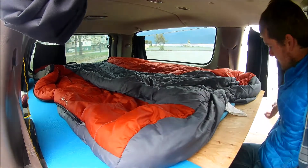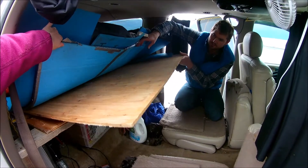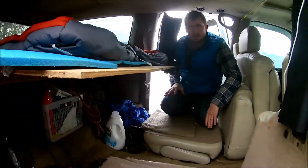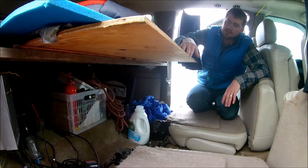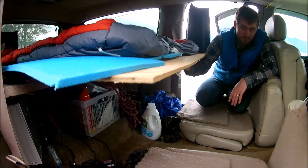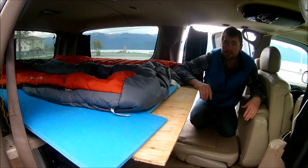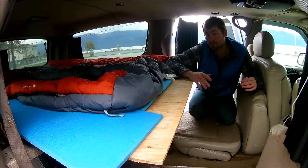With the extended section of plywood that we have here, we don't need to have any kind of leg that swings out and supports right here, because we have less than half of the sheet — this remainder, this 29 inches — over the edge of our actual platform underneath. So when you're laying down, your legs actually support it and keep it from wobbling or moving. It's a really simple system, it won't break, and it won't cost you any money that way.